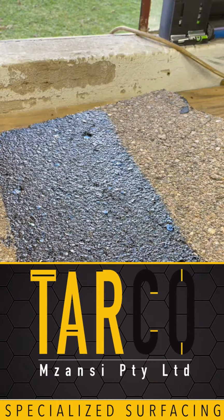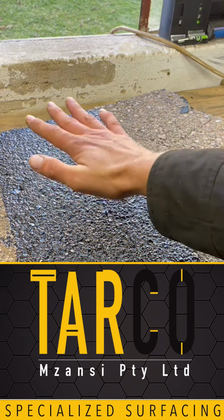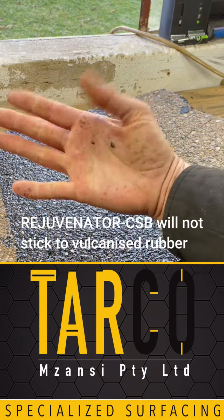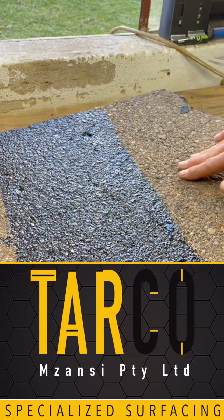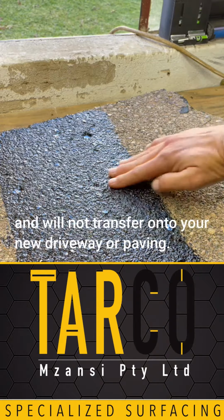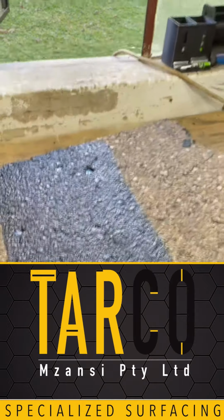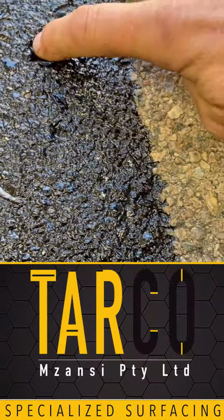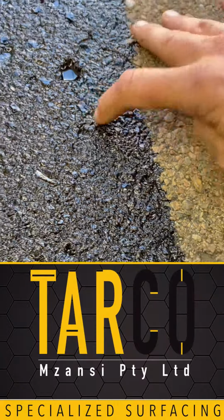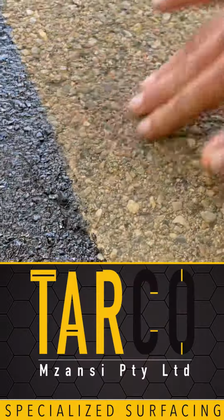All right, we're back. It's about 30 minutes after placement of the rejuvenator. And my hand is not vulcanized rubber, but even after 30 minutes, very little pickup. It would not be able to transfer onto that, even if you try. So even though it still looks wet, it isn't. The little puddle there, that's obviously still wet. So if you step with your high heel shoes into that, it'll make problems. But for the rest, it won't tread onto your driveway.